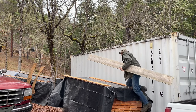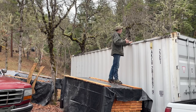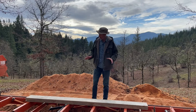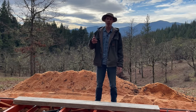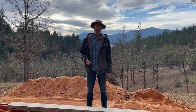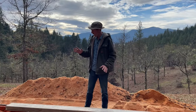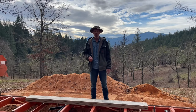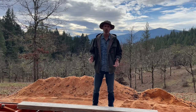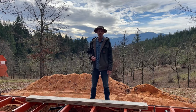We'll do what we did last time — put it on top of this shipping container. It's a flat surface where it will get rained on. Last time it was multiple boards; this time it's just one, and it'll be out of my way. Another common comment was that as these boards continue to dry — they're already pretty dry but not kiln-dried dry — if they continue to dry they're going to warp, or if they're outside in the humidity and absorb moisture out of the air, that's going to cause them to warp.